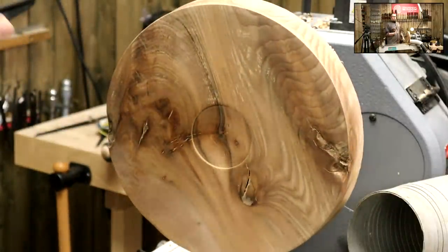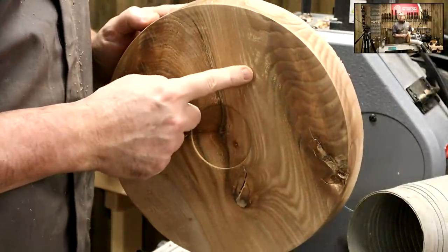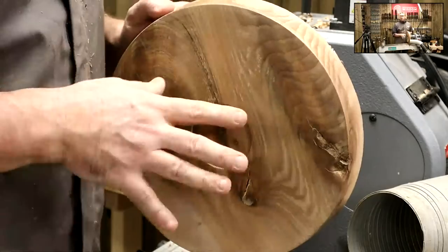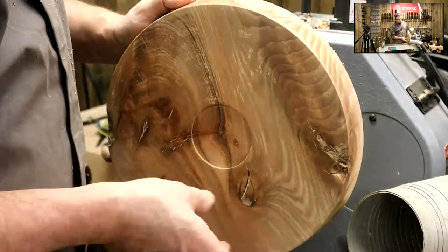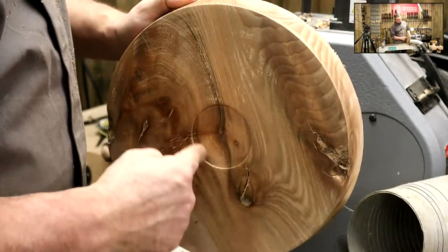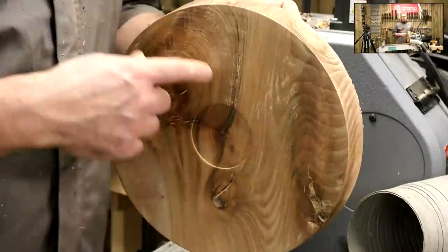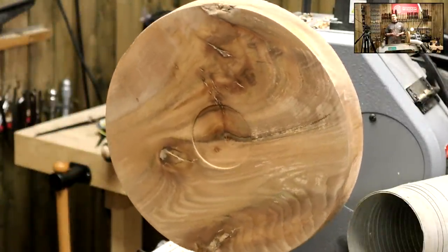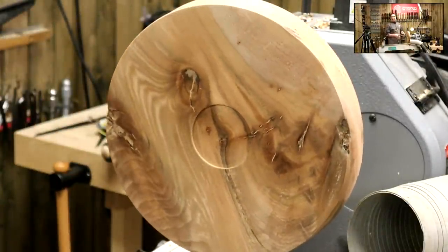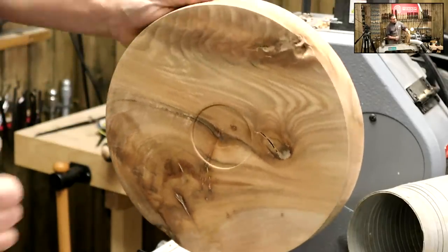Okay. So I'm hoping you can see that. You can see these little tears here. I'm going to pretend they're not there. We're going to oil on top of this. And then when you guys have gone, I'll make sure I put this back on, hold this rim and re-sand that area. But you want to keep sanding. And I would certainly, to get rid of that, keep sanding with 100 grit. So rotary sanding, power sanding, hand sanding, that sort of stuff. When they've then gone, then you can go through your grades, okay? But like I said, I don't want you to be sat there watching me sand for the next half hour.